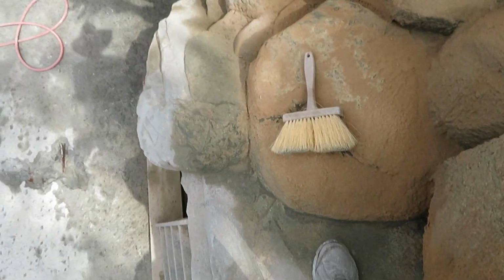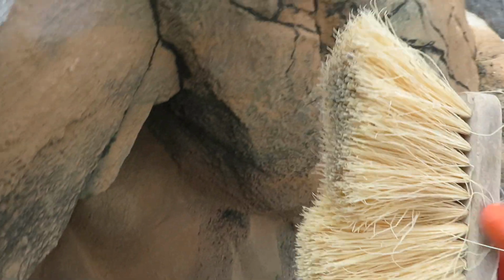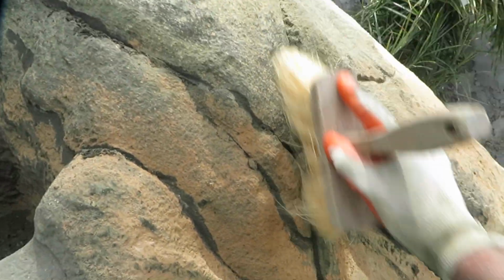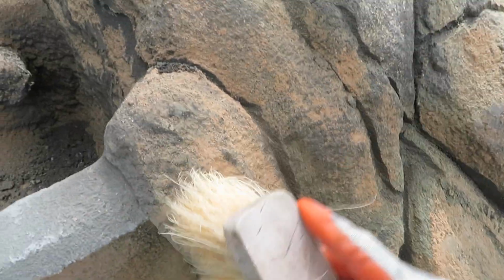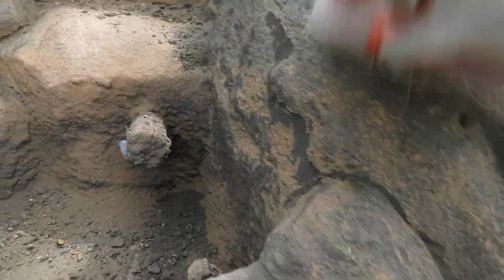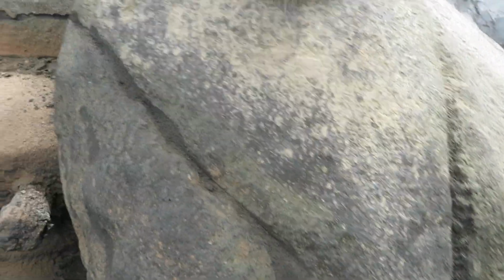After you do that, then you grab a brush. This is one of the ones I use, but you can use whatever brush you want. Then you come in and you'll start seeing the lines of the brush a little bit. So then you have to go sideways and let it cook a little bit more. And then the mortar mix won't be as vulnerable to your brushing. And you kind of make swirls.